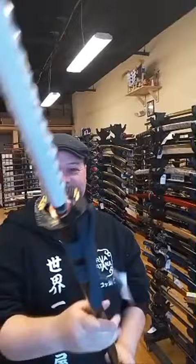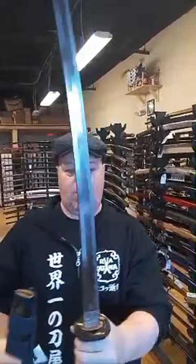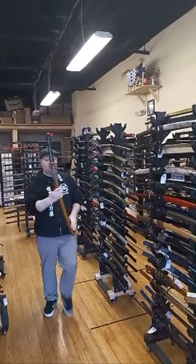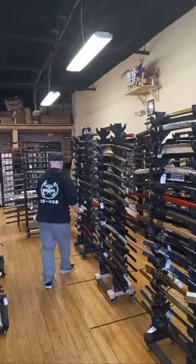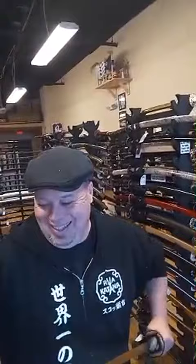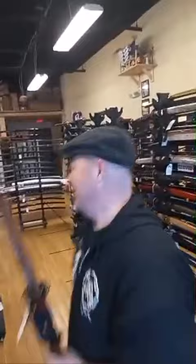Someone was asking about S5 versus S7 steel. Both are shock steels. S7 is a little easier to heat treat but not as durable. S5 is about 10% more durable. Based on heat treatment, the average is 168 joules to break S7, and 186 joules to break S5. In comparison, a T10 clay tempered blade takes 10 to 12 joules. Here's an S7 right here from Heaven and Earth - we call it the Unbreakable Faith. This isn't even on the website yet. Unbreakable Faith - that's what that is.